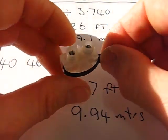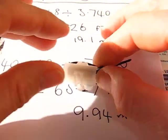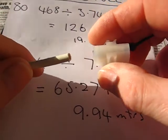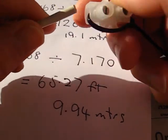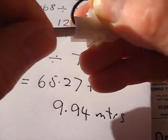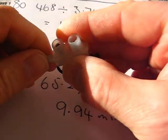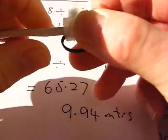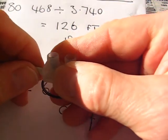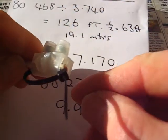Now we've got this block. One of those small tie wraps — any tie wrap as long as it goes through like that. The end is going to be the end of the dipole. We're not going to use any special ceramics or insulators; this will do. Now you can shove that through so that it's just nearly to the end. It should go quite easily. There it is, near to the end.